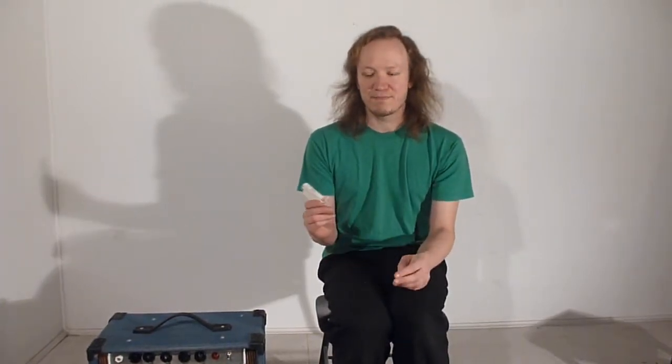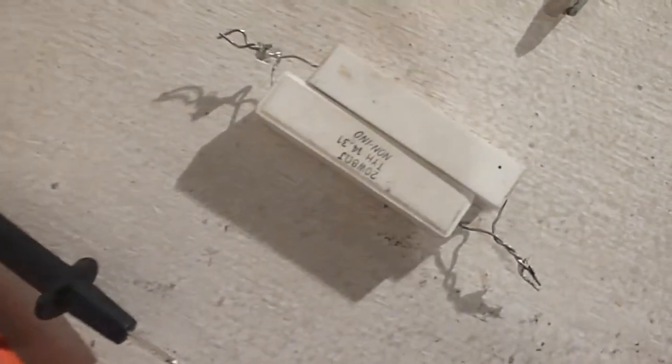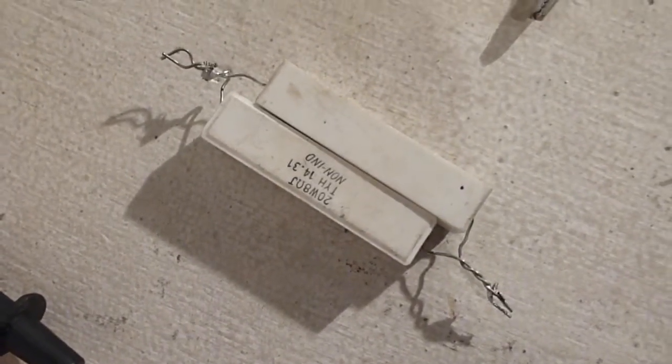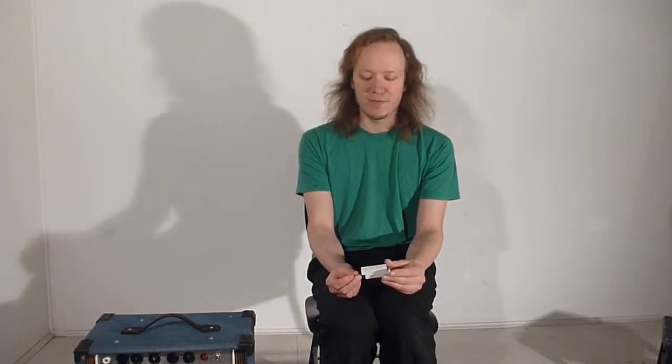The kind of resistor you need has to match the output impedance of the amplifier and also be rated for enough power. I have a pair I got from Radio Shack when they were closing — nothing special. They're rated for 20 watts each, so combined they're good for 40 watts. These are each 8 ohms, so wired together in parallel they become 4 ohms, and that's because this amp is 4 ohms.